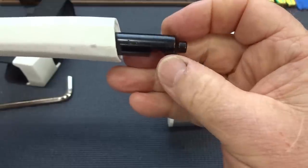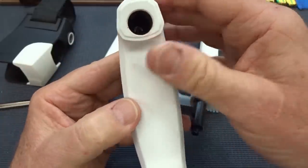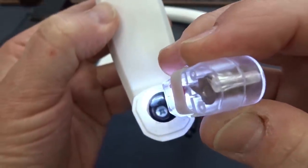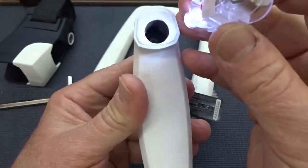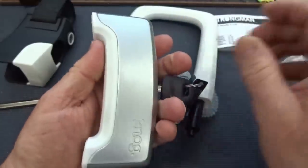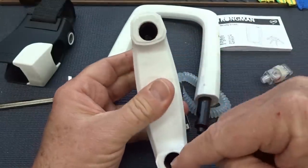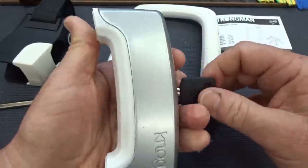When we open this up, you notice we have a half moon shape which leads me to believe there are ball bearings inside. But indeed there are no ball bearings — instead there's a steel rod that's rounded off that fits into that groove on both ends. Also on both ends there's a Phillips screw in the bottom. It's only accessible when the lock is open and the shackle is removed. Being curious, I went ahead and tried to remove those screws to see what's inside. I took both screws out but couldn't get it open. I think they probably put some epoxy during assembly, squirted it down inside, mashed it together, and then used the screws to hold it while the epoxy set.